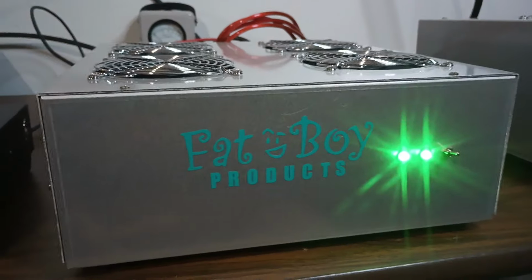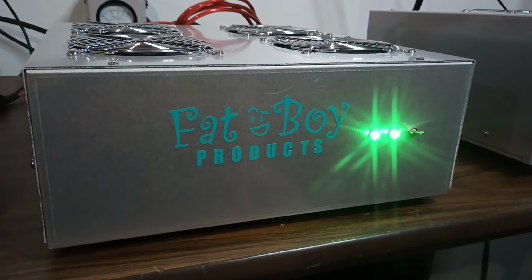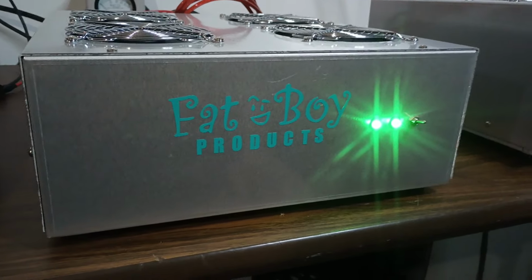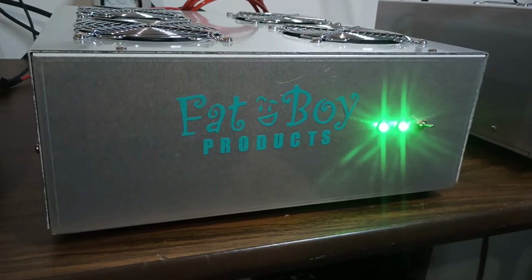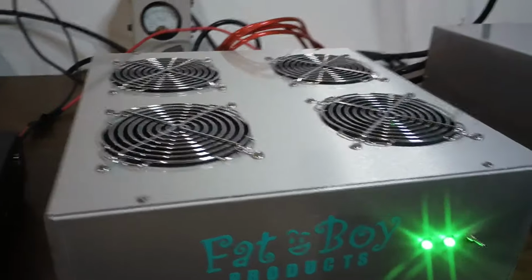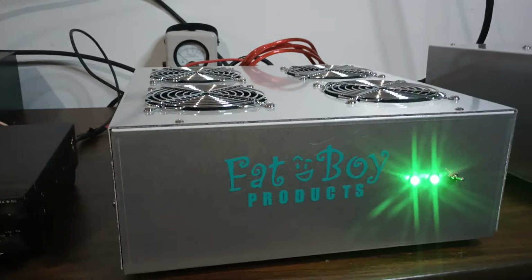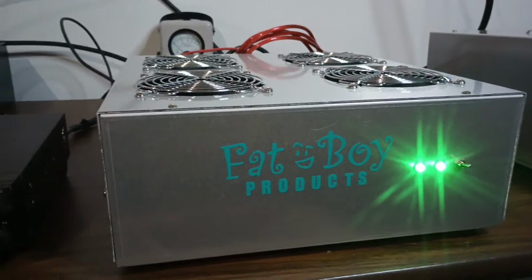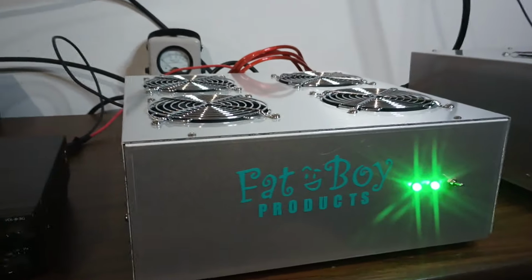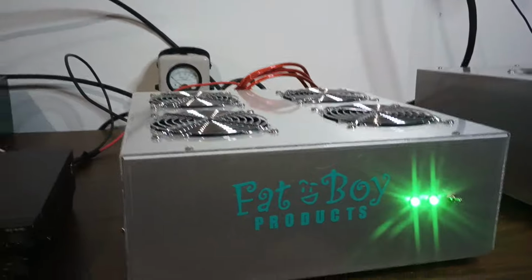Now, this being a 10-pill C-box, obviously we can hit it with, I would say, 400 to 500 watts PEP pretty comfortably, and a couple hundred to probably 225, 250 average going into it. 16-pill cabinet here. The customer also got a 2-pill 2879C, which we will do a little bit better output test on. But really, I'm just awaiting my new bench power supply to come in. Timber Reaper's hooking me up with an 800 amp at 15 volts and just waiting for it to come in.